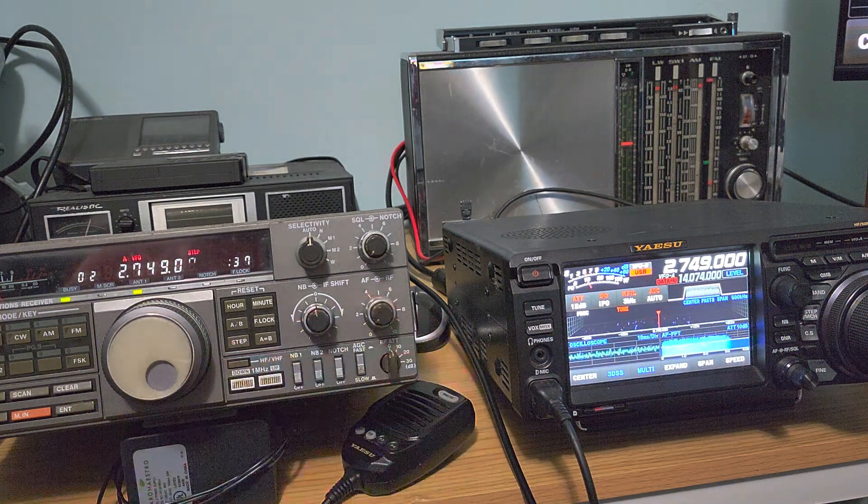It's obvious that having both antennas is a plus, because the NFED gives me the high frequencies that the MLA-30 has more difficulty getting — it's not impossible, but it's not as good on the MLA-30. And the MLA-30 gives me the low frequencies that the NFED is just too noisy for — I'm not getting anything. So that's another good example to show you here.